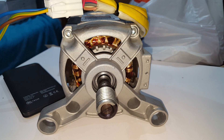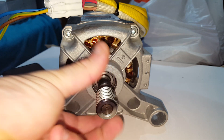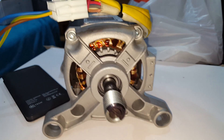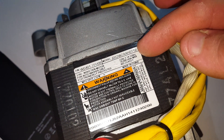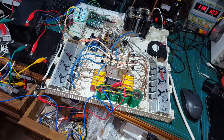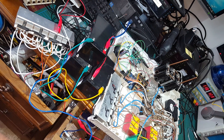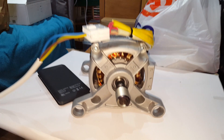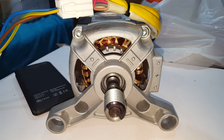Welcome to AC motor control. I've done away with the BLDC motor and I've got my first induction motor. I'd like to show you something really cool before we get started. It's a 220-volt motor, a high RPM motor, hooked up to good old Betty. I've got this on 36 volts — three SLA batteries — not even fully charged, about 12 volts each. What kind of speed do you reckon we can get out of this little induction motor? It's completely standard, not been rewound.